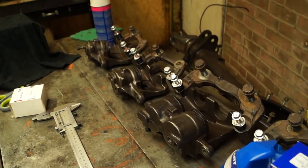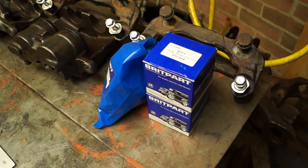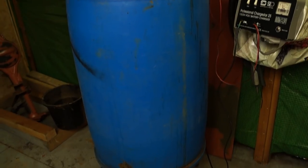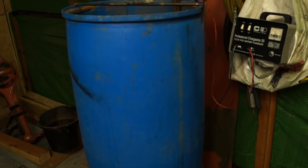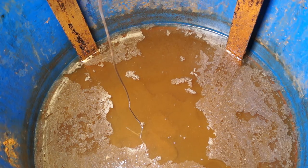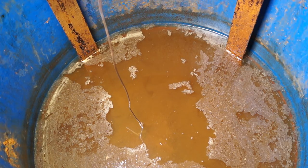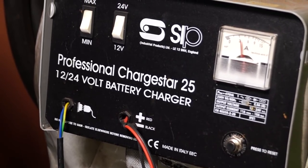As you can see, we still have one that is not ready — it's actually in the electrolysis tank here. I've given it a good dunk and it's going to stay in there for a couple of days. The electrolysis is going to get the rest of the corrosion off — this is the easy way of doing rust removal. You can see it's happily bubbling away there; I've got this on 24 volts pushing about 3 to 4 amps through it. We'll leave it a couple of days and come back to it.